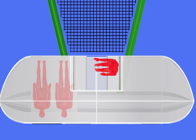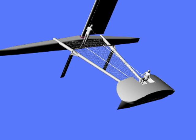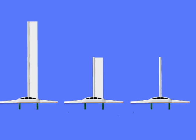On future boats the aim is to have no laminating post infusion. All components will be matched and just require gluing together. This will save weight, materials and time, plus provide a very simple to assemble kit boat.